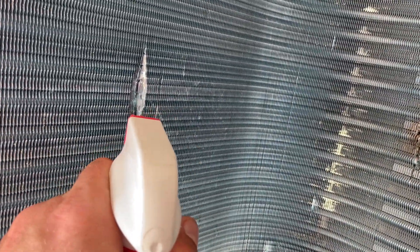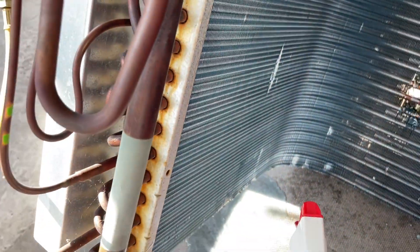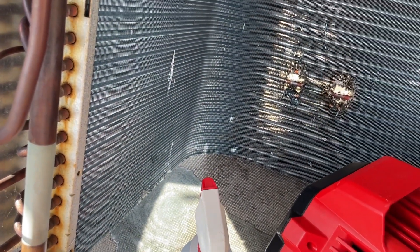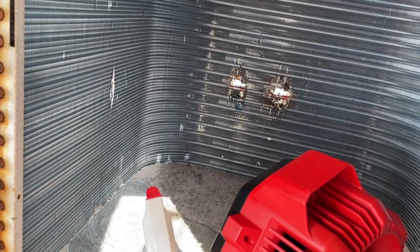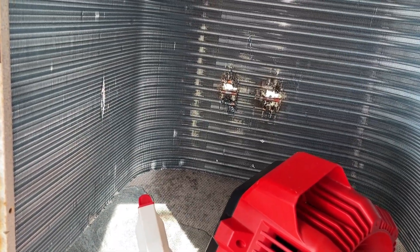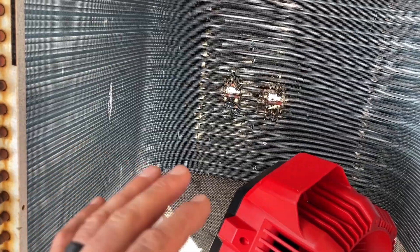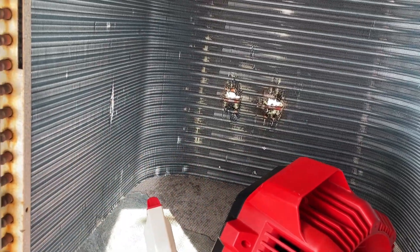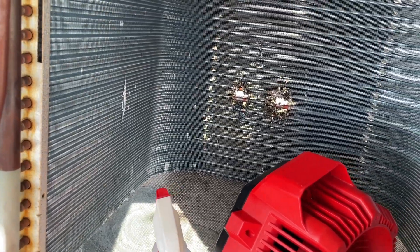Sometimes I just feel like I'm paddling upstream without a paddle. But we have another leak somehow on this same pipe right here. So I'm going to take the entire circuit out and just be done with it. Now what could possibly have caused this besides maybe shitty quality control? I know that another company has been doing the PMs out here, and I think they just recently washed coils. Did they hit the coil while it was running and hot and just kind of caused these cracks? I don't know — it's very weird, but I'm going to take the entire circuit out because I just can't chance it anymore.